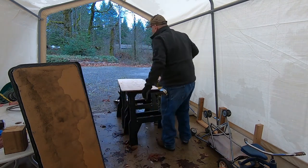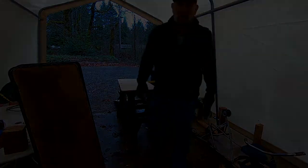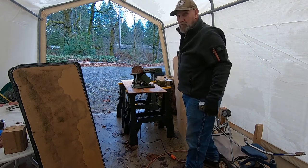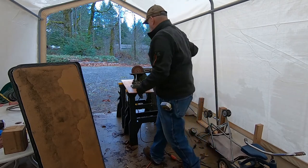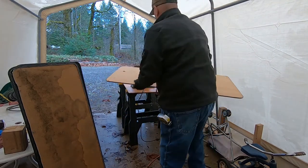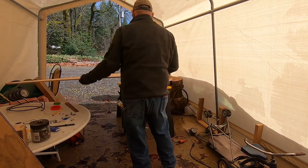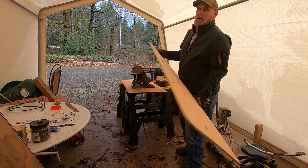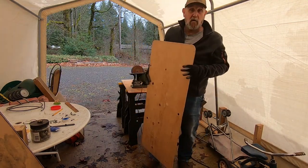We've got these things cut. Our next step is to sand it down, make it smooth, and start putting a cover back on it. A nice cheap tool to get is a six-inch disc belt sander — does a whole lot of good and saves a whole lot of elbow grease. You can't put too much pressure on this thing though. No wonder they sold it to me for 20 bucks at the swap meet! I think I'd be better off using a hand sander.